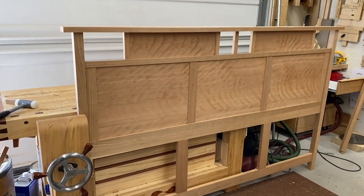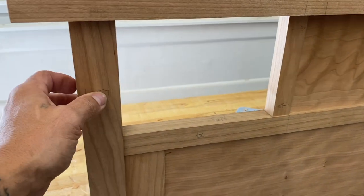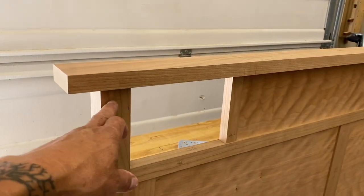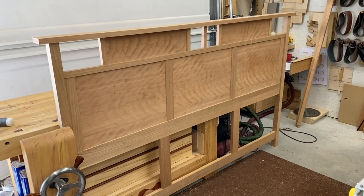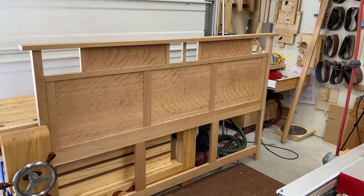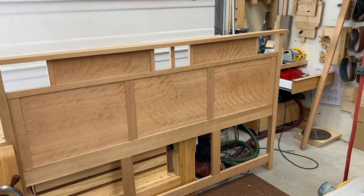There's the headboard — all the panels fit. Everything's really tight. This needs a connection here. I actually goofed when I cut these legs — I forgot to add for the tenon — but no big shake. I'll just put a couple of loose tenons, what they call loose. It's a kind of a weird name because they'll be glued in tight — floating tenons is also a weird term since they won't be floating. But separate, not integral. I'm liking it. Of course it's blocky — it needs a little detail. This will get chamfered, but yeah, progress.